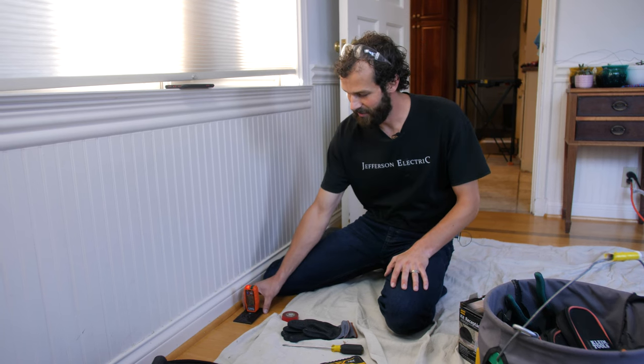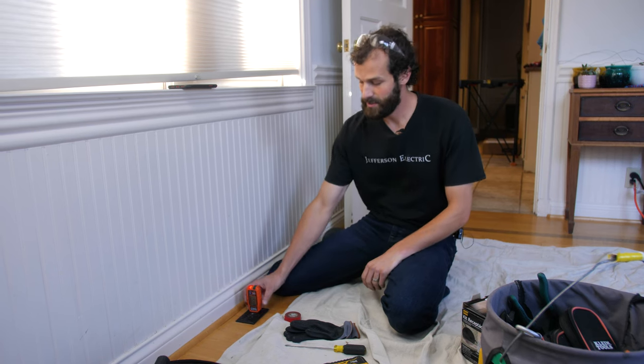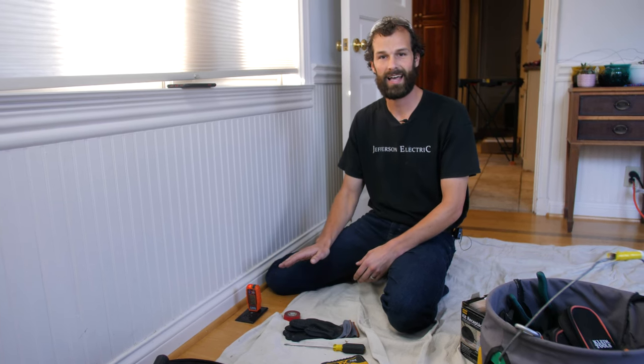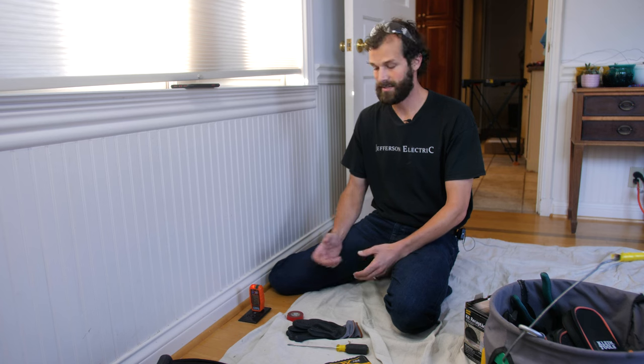What's the issue with this receptacle? Might be your question. It looks fairly good. It's actually a relatively new receptacle, but here's the deal. That receptacle puts everybody at risk for shock hazard. Just picture this. You're walking through the dining room or you're locating a piece of furniture and you step right on that receptacle. This is lightweight plastic. The risk that it could break and cause an arc or a shock to somebody or through a piece of furniture to somebody